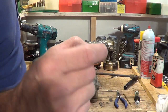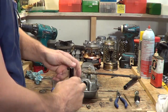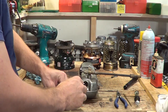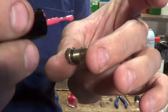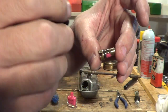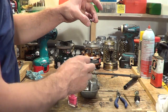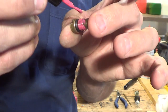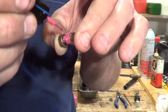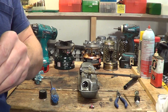Now I'm going to get my check valve ready to install. I have some fingernail polish — and you're probably thinking I'm crazy — but what I like to do is polish up the threads on things, just like so. Doesn't need to be a lot. This works almost like a Loctite; it's a very loose one — it doesn't hold things gorilla tight — but it will hold them in position. Plus, another thing it does that I like: it will seal the threads, so if any air was going to escape from the tank because of those threads, we're now minimizing that.